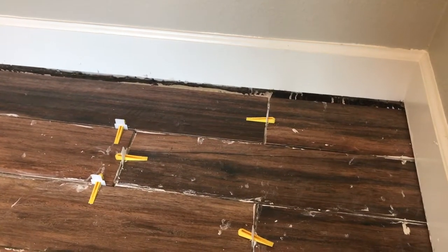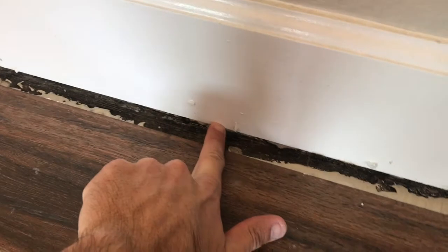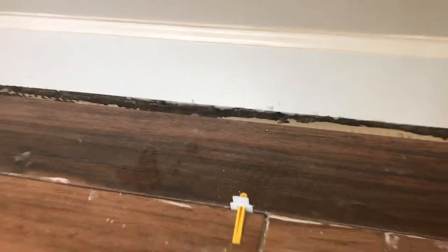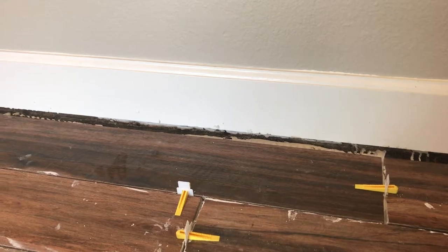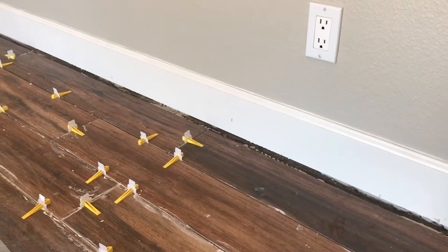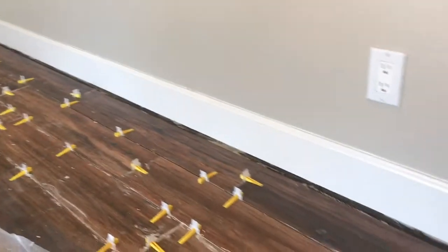And there you have it — that's the last course. A little bit of pre-planning may have saved me from this, but I have about a half-inch gap between the baseboard and the edge of this tile. I've tried ripping a tile long-wise into a one-inch strip, and it's literally impossible, at least with a grinder. There may be other tools out there, but what I'm going to do is get a piece of three-quarter-inch quarter round and do this entire wall strip to finish it off.